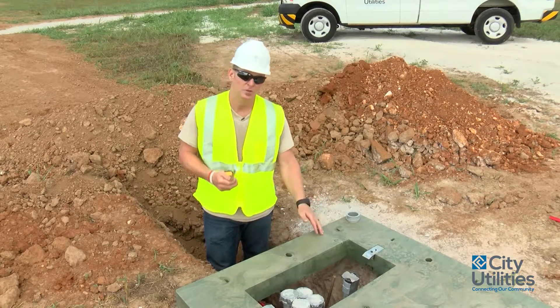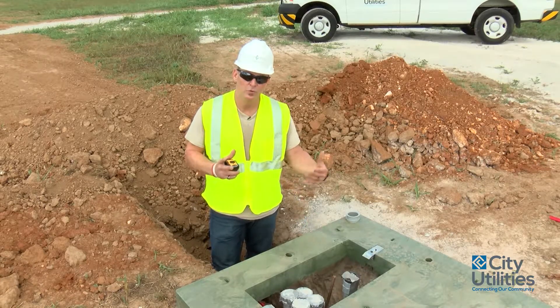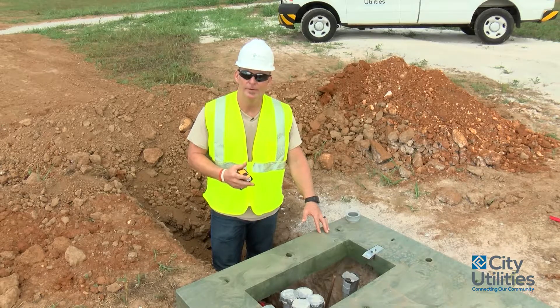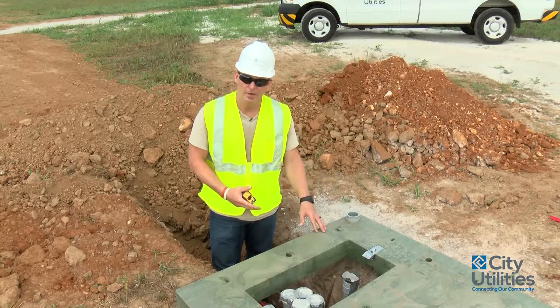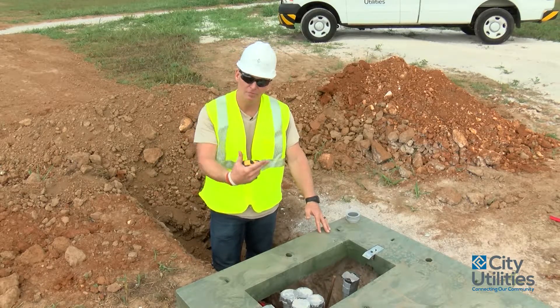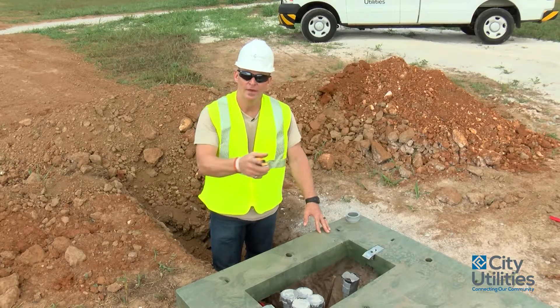These are the way the transformers are made, so you need to get with your engineer regarding how you may want the transformer lid in the back to open. It's not uncommon for primary and secondary conduits to cross to accommodate a better-looking product and have the doors open the way the customer may want. We always have to have a 10-foot clearance in front of the transformer and a three-foot radius all the way outside.